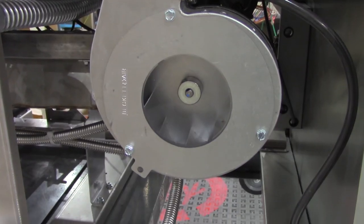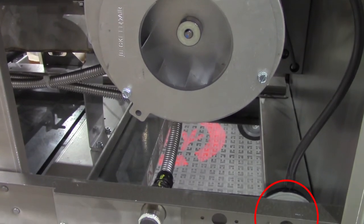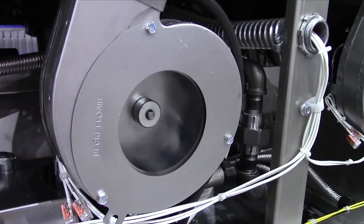This check is to ensure the pressure switch is not stuck closed so the control can detect a definite change after the blower motor is energized to prove that the blower is running. A common reason to get the E20A error is if the store splashed or sprayed water on the floor and the switch got wet.